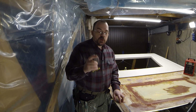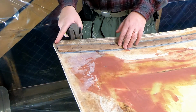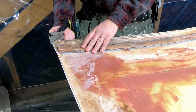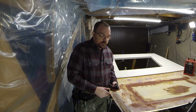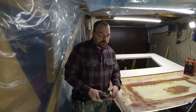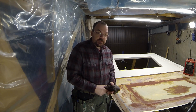What I asked people was, do you have any idea how to fix a crack like this? I have a crack over here in the roof, as I showed you. It has to be fixed. It's a 5-10 centimeter long crack. The idea people had was to take out part of the wood and then fiberglass from the inside. And I actually think I'm going to do that.